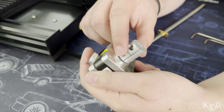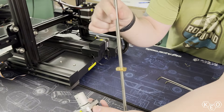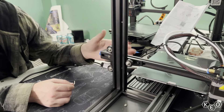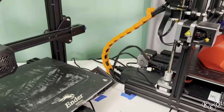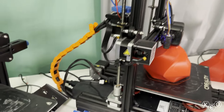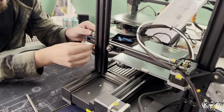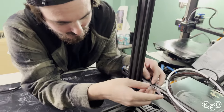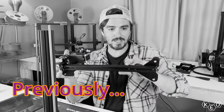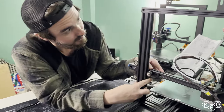This is a little split deal - you tighten that one and it clamps down on the z-lead screw, and then this one if I loosen that would have the coupler come off of the motor. So our motor spins, spins the thing, makes the up and down. So we're going to change out this bracket and take off the belt. I think this bracket stays. I think there's supposed to be a fastener in there, but I also watched you pretty closely while you put it together and you didn't do anything horrendously wrong, because I would have caught it.